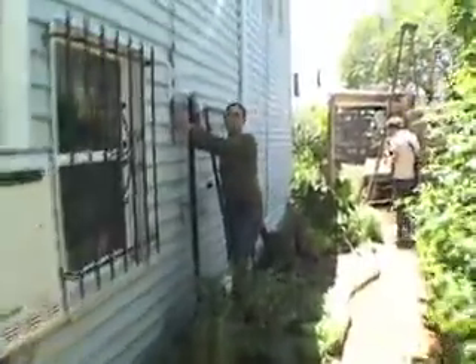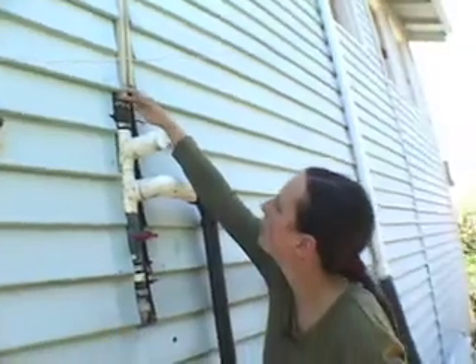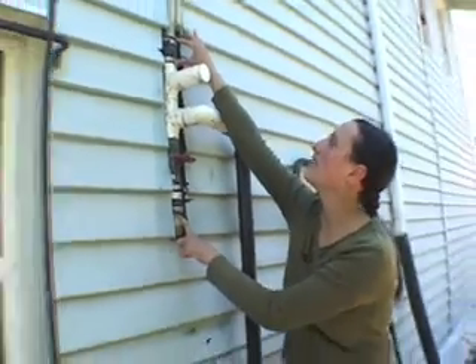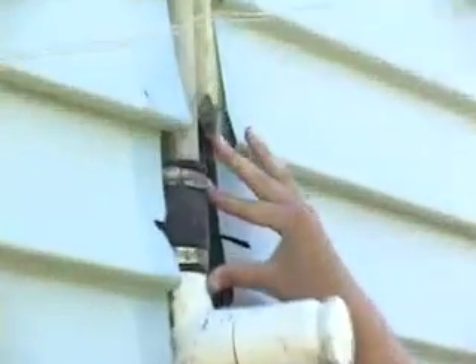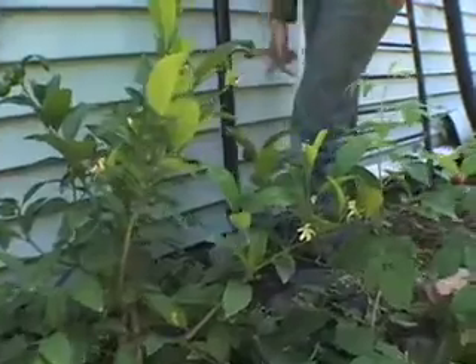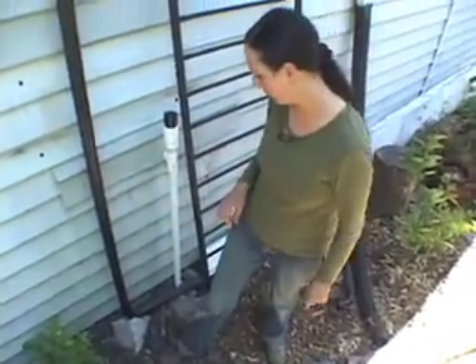This is the kitchen sink. This is an old house with old steel pipe. We cut into the pipe here and here and added adapter couplings, so it transitions from metal to plastic. This is a clean-out. It's all gravity, so it flows into this new pipe, drops down, and now slopes at a quarter inch per foot. You just need to make sure the water is flowing.